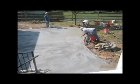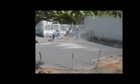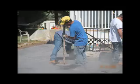This is the first step in coloring the stamped concrete patio. First, we apply a base color. We continue to apply the base color until the entire patio is completely covered. Once the patio has been poured, leveled, and the base color applied, we use the decorative concrete stamps to create the Dominican slate pattern. Here we continue to stamp the concrete patio.